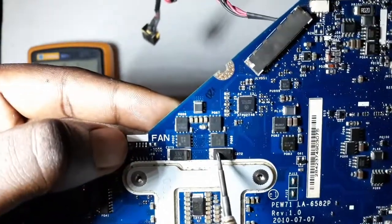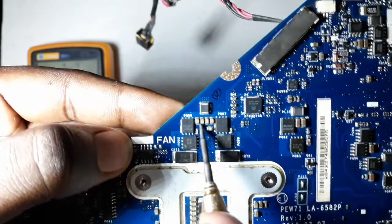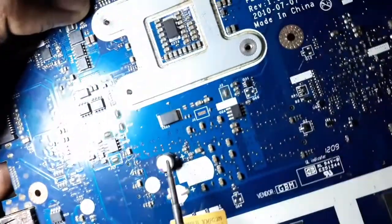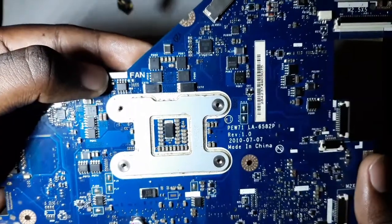Protection against reverse voltages. These capacitors are non-polarized — they don't have positive or negative; they can work in either direction. But these ones have positive and negative, that's why you see they have a label on this side. These ones are polarized, and that's why you see they have plus signs at the extreme end. Let's check — this capacitor is called C27.